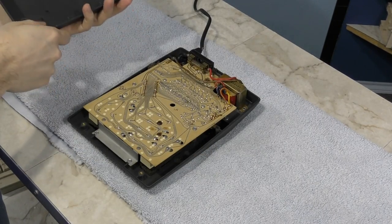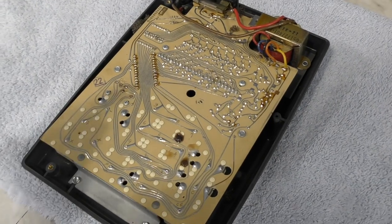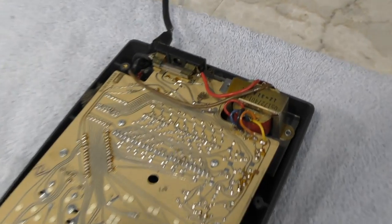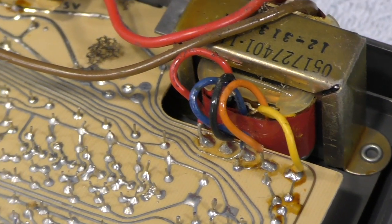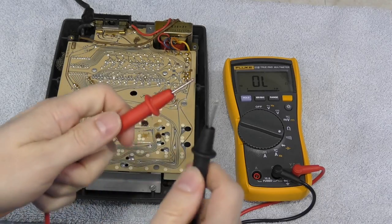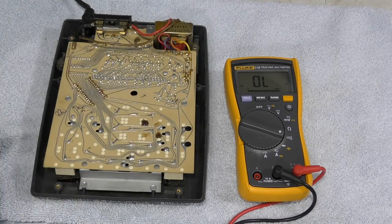That's a very interesting board. All of the traces look hand drawn — I'm accustomed to seeing computerized layouts. You can definitely tell there's a 28-pin DIP style chip of some sort on the other side. And there's a fuse, which might even be the culprit along with the transformer. Before I go any further, I should probably test this fuse with my multimeter by putting it in continuity test mode. And it does seem that the fuse is good, so I'll go ahead and remove this board.